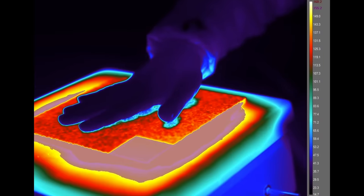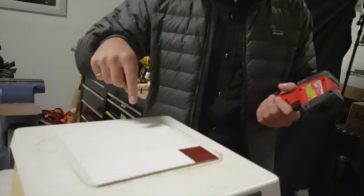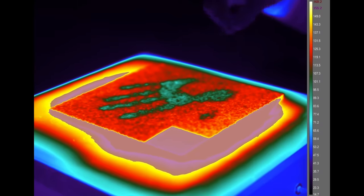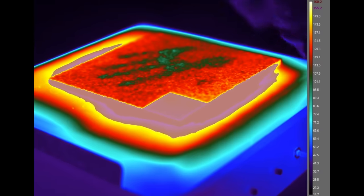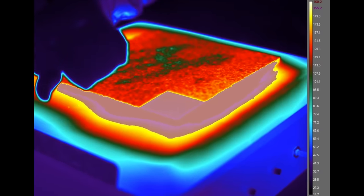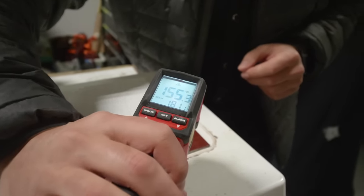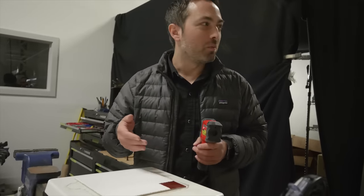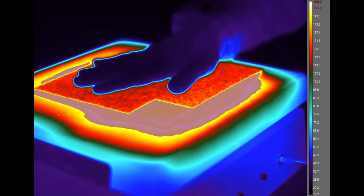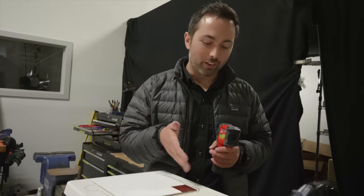To prove the point — can you see my handprint? Yeah, totally. Thermal handprints left behind, meaning I was cooling down the surface when I touched it. Over here, the uncoated part is about 180 degrees Celsius — that is the part I definitely don't want to touch because it doesn't have aerogel on it. This is such a thin coating, about a millimeter. But even that millimeter of aerogel means you can touch something that otherwise you'd be totally unable to touch. This would definitely burn you.